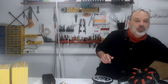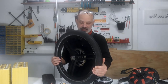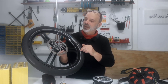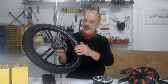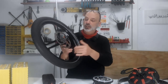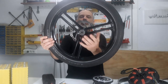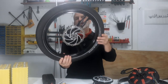Let's start with the wheels. We're going to use bicycle wheels, 20-inch size. This is one of the front wheels I'm going to use — they include the disc, which is 180 millimeters in diameter. It's mounted on an aluminum wheel, but it can be a spoked wheel as well, it doesn't really matter. The only important thing is that it has a through axle — the axle is completely hollow — so it can be installed in the real knuckles.